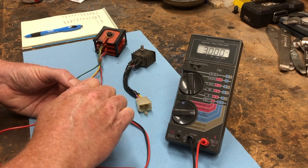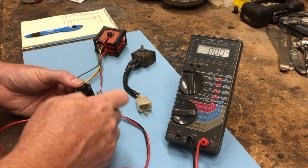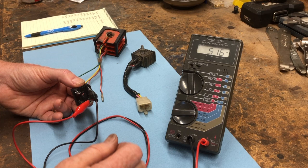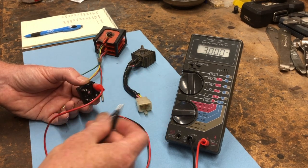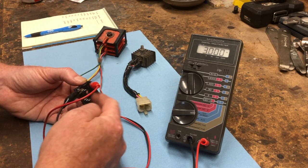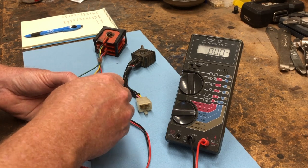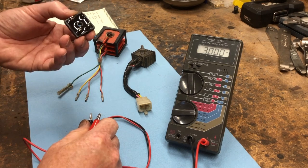Checking across to the red lead again, it's a value about twice as much, so I can check the individual upper diode within the rectifier — it checks out. Checking out again here. If I want to verify that current won't flow the other way, I attach the positive lead to the positive post on the rectifier, connect the other lead to either one of the AC posts, and it's infinite — it's open — verifying there's no flow and the diodes are doing what they're supposed to do. Checking the other individual diode here — this rectifier checks out good.